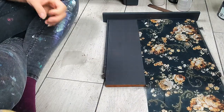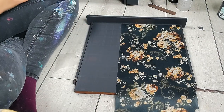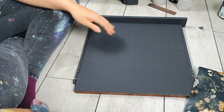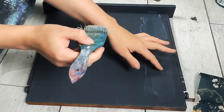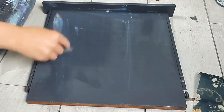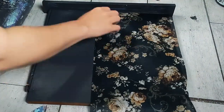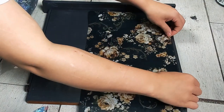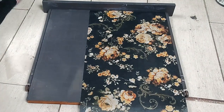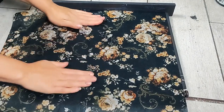I've now taken out the top drawer — it's like a little drinks tray — and I've got the dark floral decoupage paper by Redesign with Prima. I'm aligning the pieces to make sure they are smooth before I stick them down. I've got Dixie Belle flat clear coat which is going to act as a glue. These decoupage tissue papers by Prima are actually not like tissue at all — they're more like cotton, very strong and soft. I just love using them as drawer liners. I'm applying good coverage of flat clear coat over the top of that drawer and applying my first layer of decoupage paper, smoothing it out with no rush.